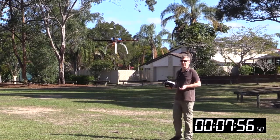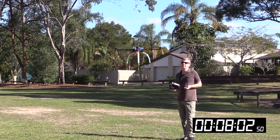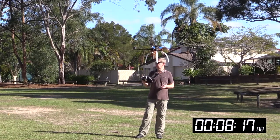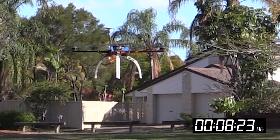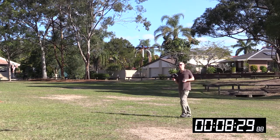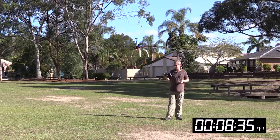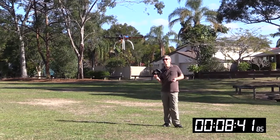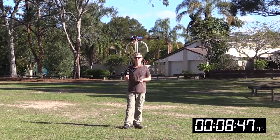I think it was 11.1 minutes suggested, so if I get something like that I'll be happy. The LiPo voltage is being reported as 11.1 volts and I'm seeing the LED flash — the first stage protection of the Wukong was set at 11.1, and the LED flashing indicates that's been reached. The second stage protection I think I set to 10.8 — that's where the quad will do an auto land and gracefully come down.